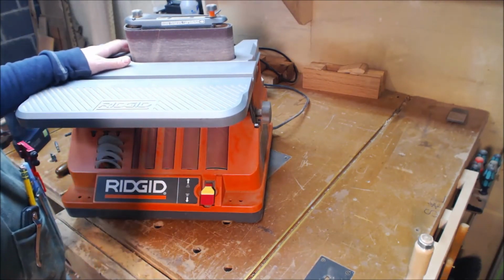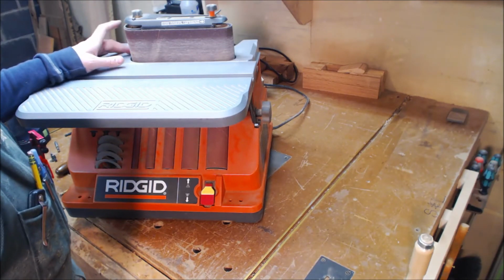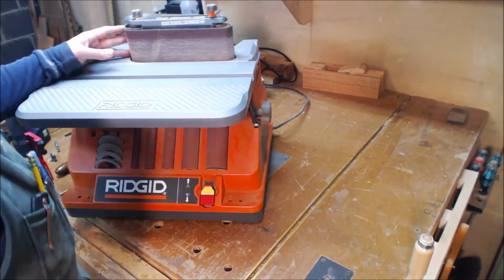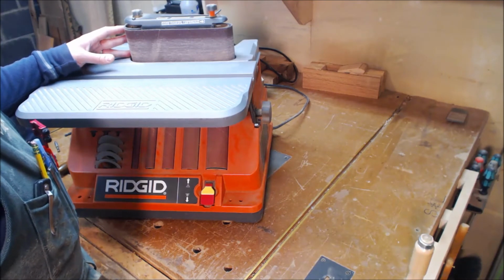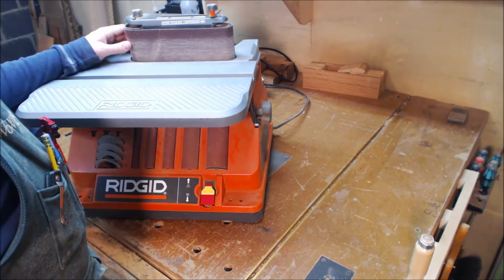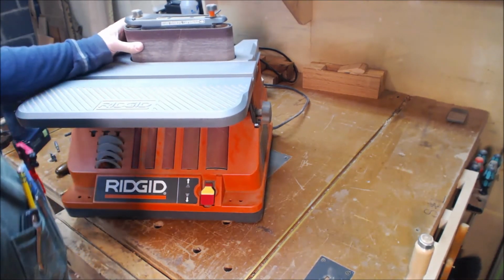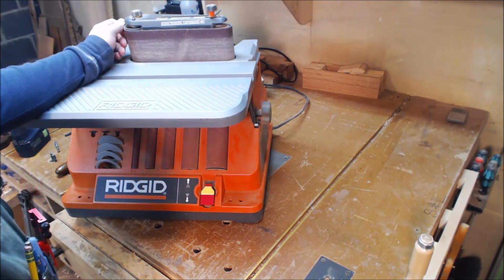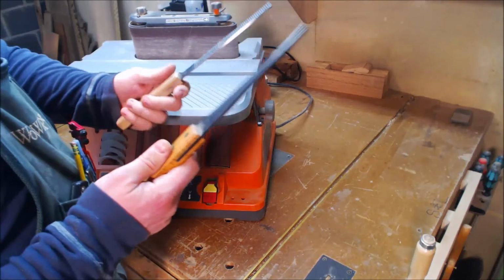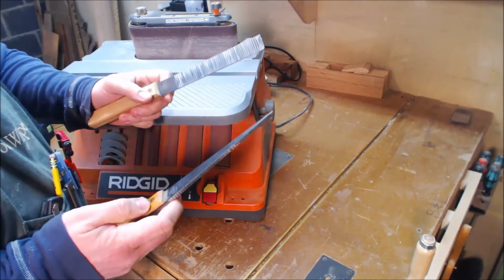As for a spindle sander, it comes in very, very handy for making a plane for multiple different aspects of it. If you do not have a spindle sander, I recommend getting 3-inch PVC and wrapping it with some adhesive-backed sandpaper. Probably about a 6 to 12-inch piece of PVC is all you need, and multiple grits of paper you're gonna want as well.